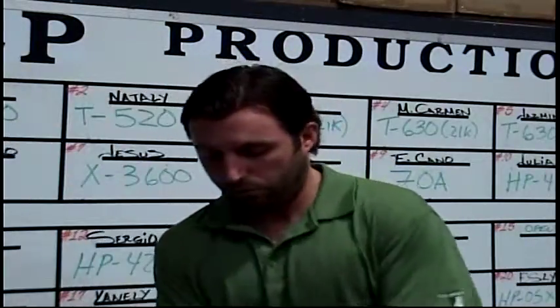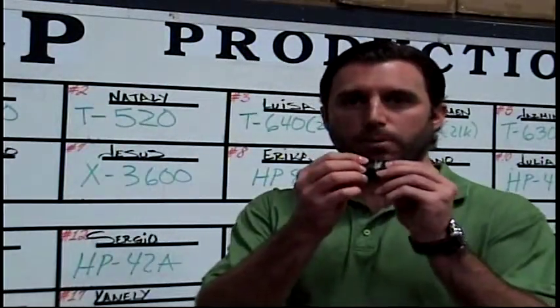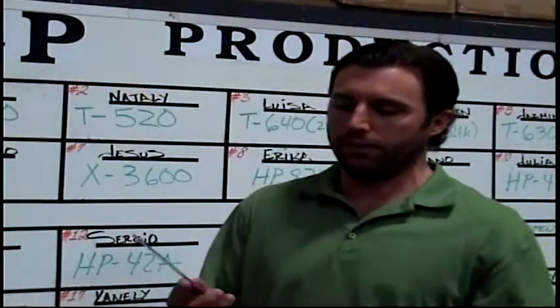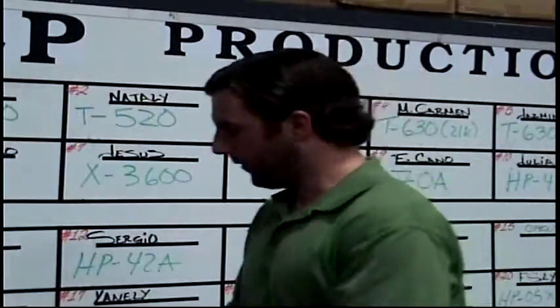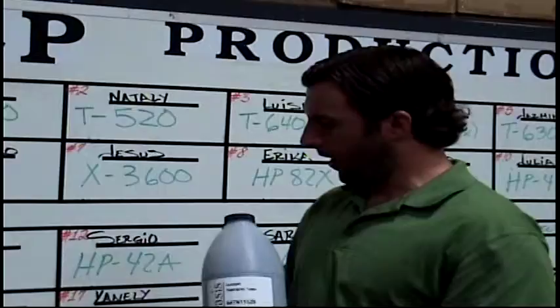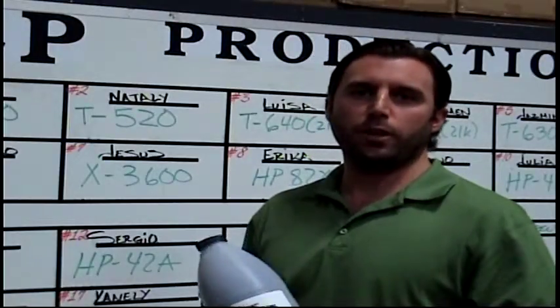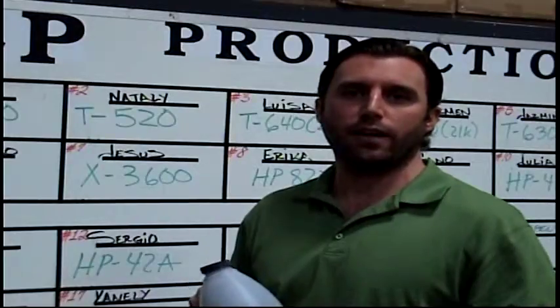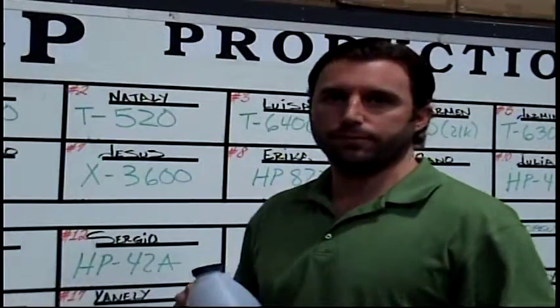You also get a brand new chip. And then there's a couple parts in the cartridge that get worn out, like the OPC and the cleaning blade. Finally, you have the toner. We replace all of these components every time we remanufacture a cartridge, and we think it's why our quality is above and beyond the rest of the product you find on the street.